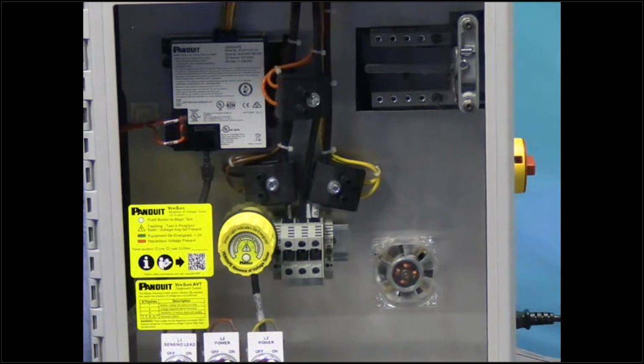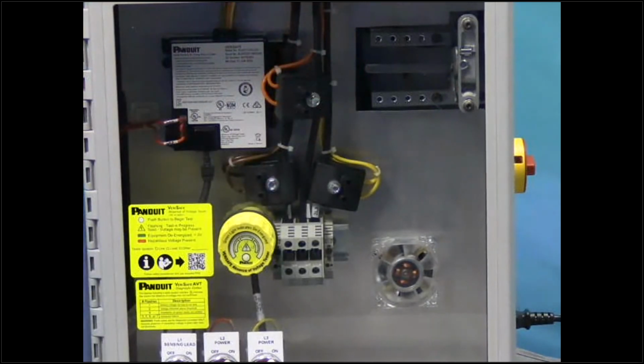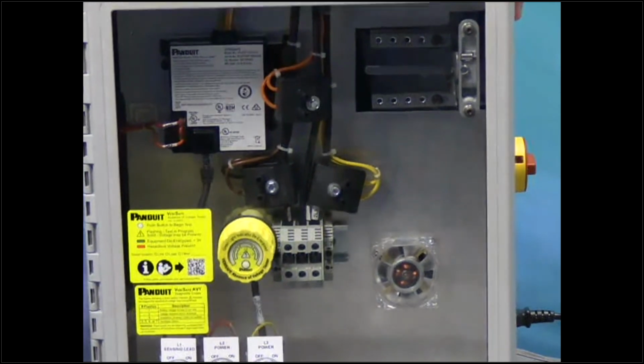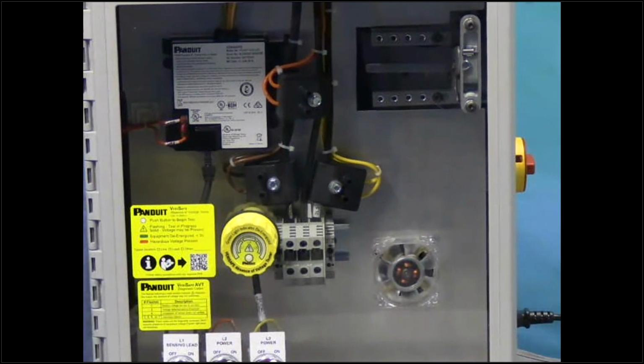So the last thing I want to show is the access control. So you notice up here, we have this electronic latch installed, and you can see here that you've got the output contacts on the isolation module, and you've got some wires running there. So what those wires are doing, those outputs are going to close when the green LED is illuminated. And what I'm going to do is, I don't think you can see it on the screen, but there's a latch up here in the top corner of this demo. I'm going to unlatch that so there's nothing really holding it back.